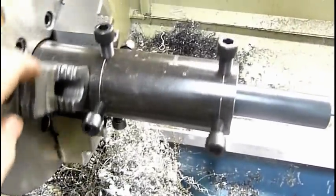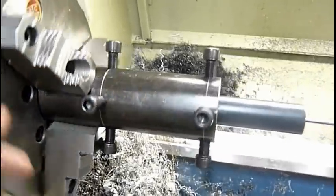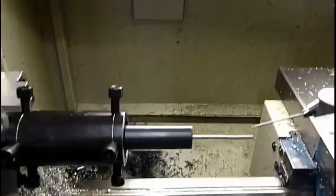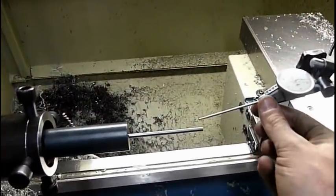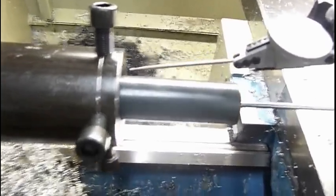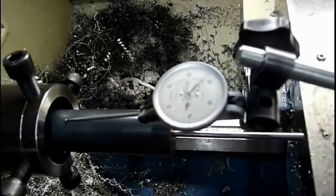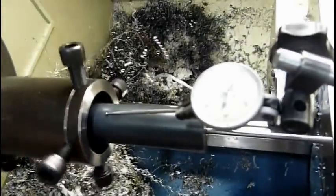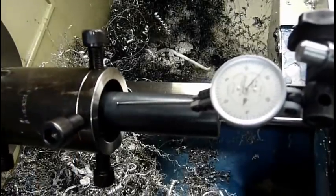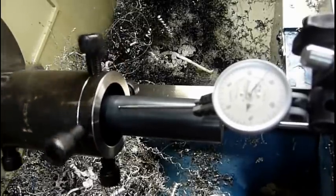This fixture gives me two independent points of contact adjustment. What I can do is put my indicator up a little bit and then move it in. What you do is you dial in close to the first point of contact first, and then as you spin it, you dial in these four screws until you get that part centered. And you can see it's pretty centered — it's within a couple thousandths.